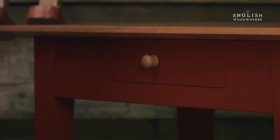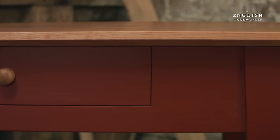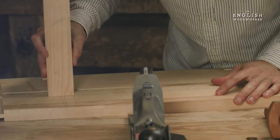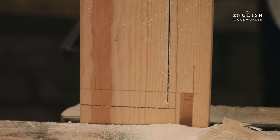Using design restraints, we're trying to keep things efficient but also interesting. There's a few slightly unusual details in this piece that mean we can bang it out — most of them you won't even notice until you come to build it. The first one makes drawer construction a doddle, and that's because it's just a U-shape chopped out of the front apron, unlike that conventional sod of a job rectangle.